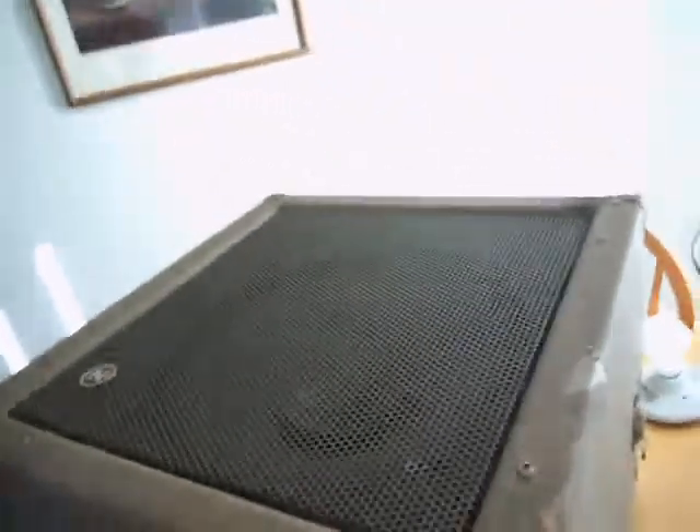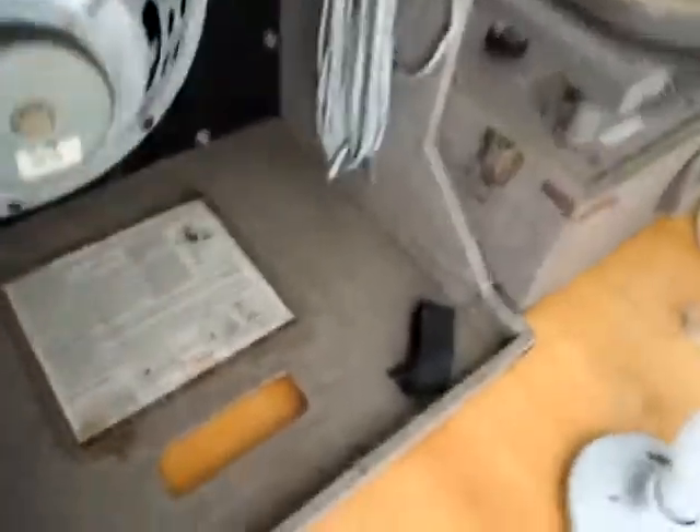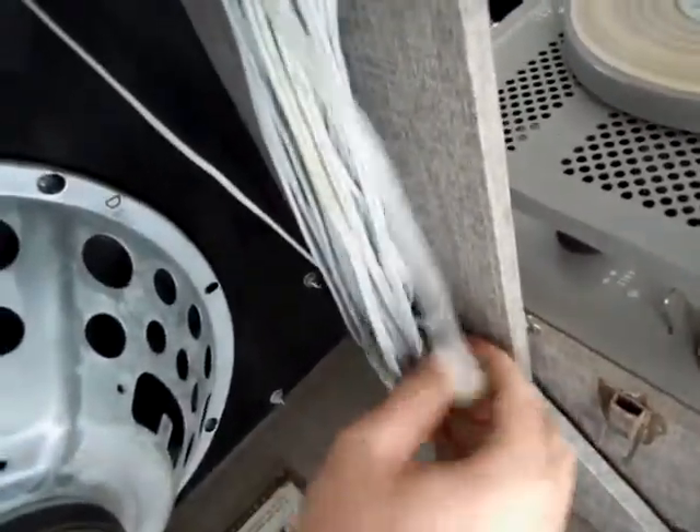First, I'll give you a rundown as to what the insides are like. The speaker, which is also the cover, detaches. I'm going to set this down here for the viewers. You can see here a very large 12-inch full-range speaker. Depending on the coupling of the output transformer of a tube amp, it's not wise to operate it without the speaker or load attached, so we're going to do that just for safety's sake.